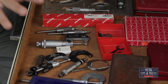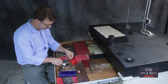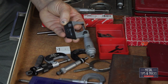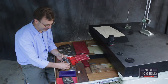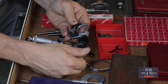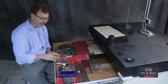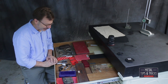This corner is set up with what I probably use the most. I've got my one-inch Starrett, accurate to a ten-thousandth. I love these Brown and Sharps — they call them a digital mic, and they have a series of numbers that clock in an interesting way. I'd love to take one apart and show you how it works someday. They're accurate to ten-thousandths of an inch and really quick and easy to read. They also made a metric version — given to me at John Saunders' Open House in 2016. I just love having at least one metric tool.